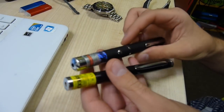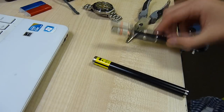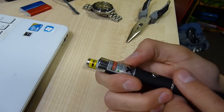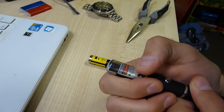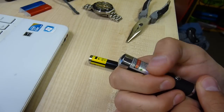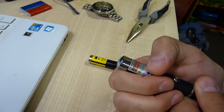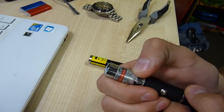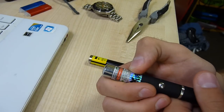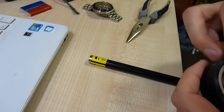Now let's show you something else. Bearing in mind this is also supposed to be under the same rating. In fact, you can see the sticker there. I'm going to show you what first started the alarm bells ringing with this thing. Laser radiation. Avoid direct eye exposure. Next thing is when it's saying it's a Class 3 laser product with a less than 1 milliwatt labelling on it. Less than 1 milliwatt is Class 2, and anyone who has done any research into lasers will know that.